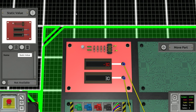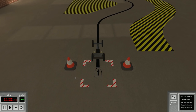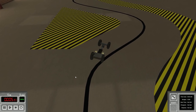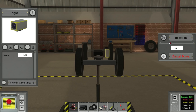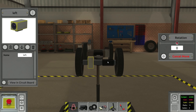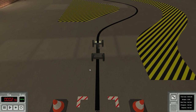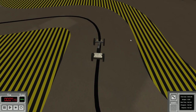It goes the wrong way. We've got the sensors hooked up backwards - we'll just reverse this. This will be 30 and this will be negative 30. Now this should steer. As it picks up the line you can see perfect steering - oh, too much. We'll move the sensors up to the front bar. We should be able to move them without too much issue with the circuitry. There we go - now it hugs the line perfectly.